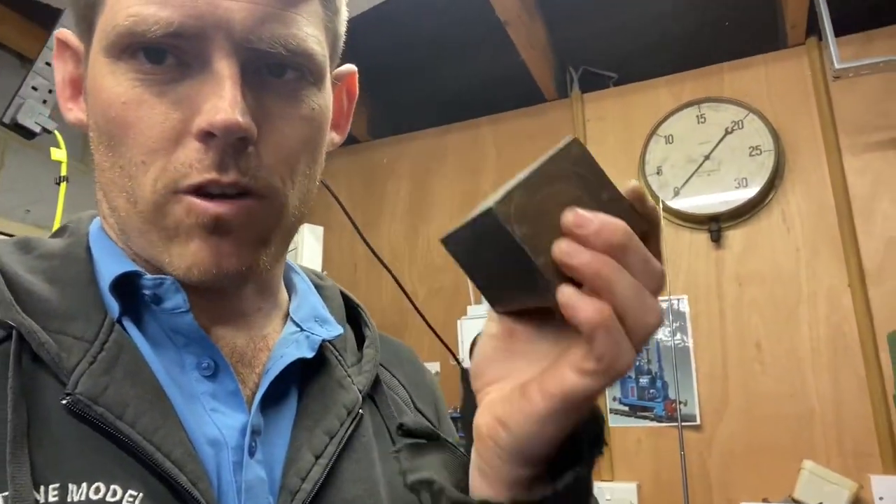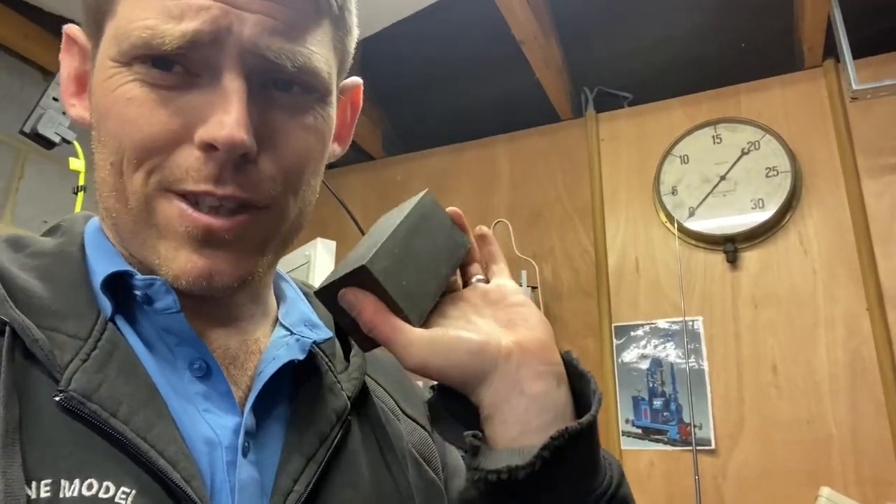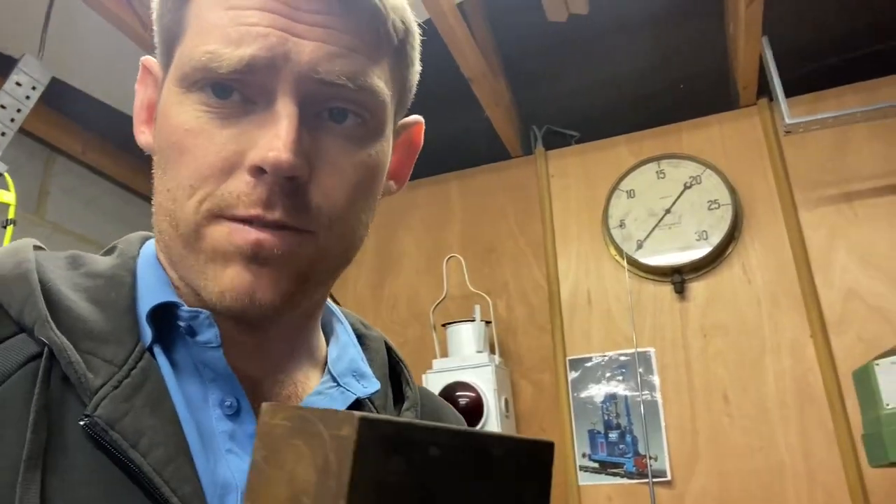For the external piece, I've got a little bit of two-inch bar, so we just need an inch and a half slot — just over inch and a half because you need the thickness of the sheet. I've got an inch cutter, so we're going to put a groove down the bit of bar and see where we go from there.